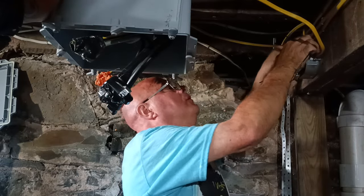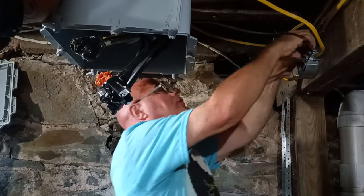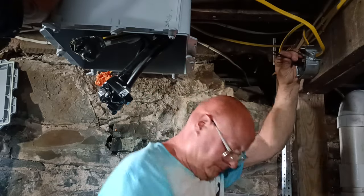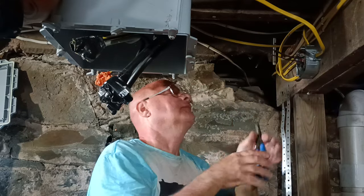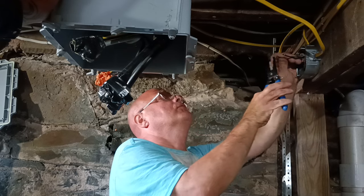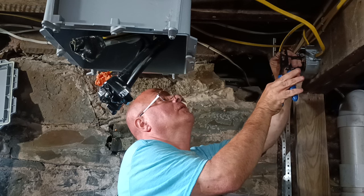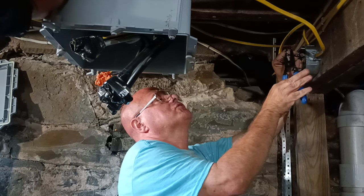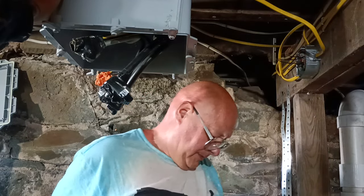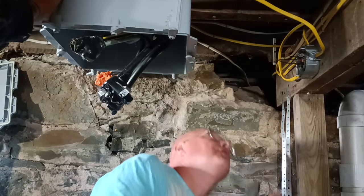What gauge wire do we have to run for that box? If we're doing just 50 amps, number 6 copper. The same thing we ran for the stove. The same as the stove size wire, but it had to be UF because it's going underground and outdoors. That'll run a garage door opener and compressor and stuff?